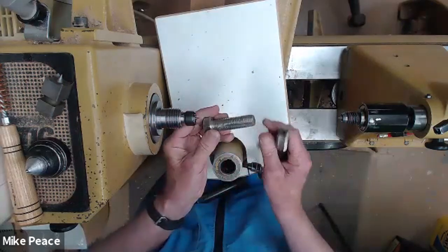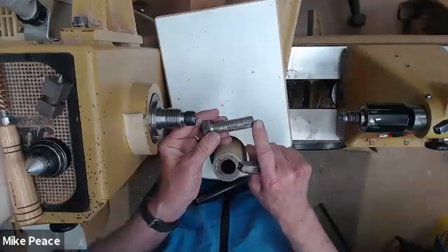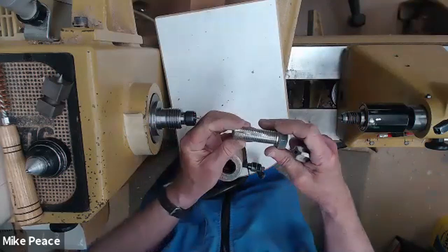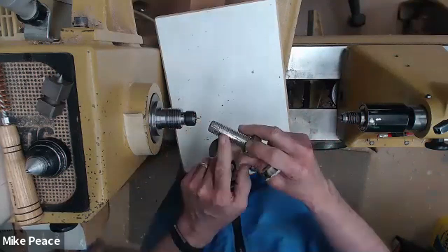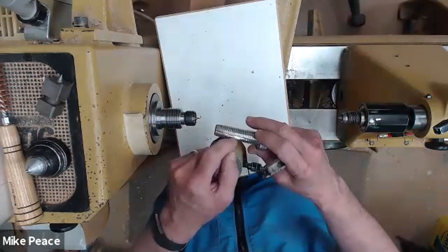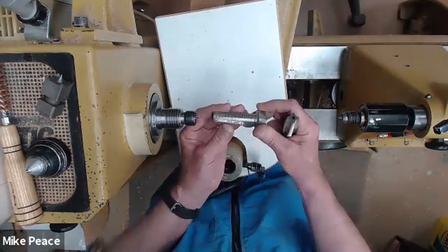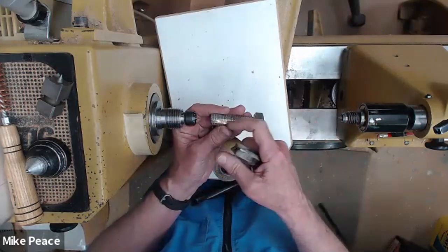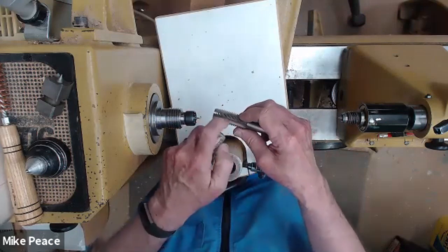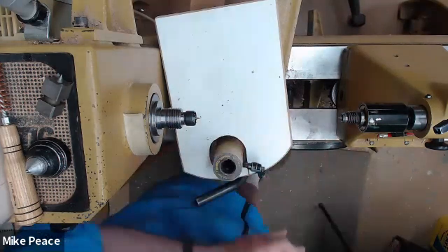So if you take a bolt, you can take your 4-inch angle grinder with a metal cutting wheel and cut slots. Just make sure for the slot on the left-hand side, the cutting side has a nice sharp edge. The other side doesn't make a lot of difference. And this one, I didn't make it very good, but it works. I needed to open this up a little bit more because it's going to collect some shavings in here while you use this as a tap.